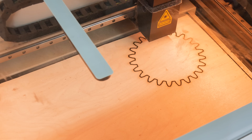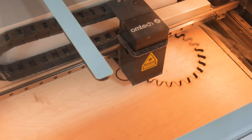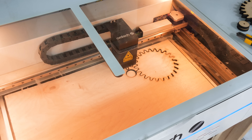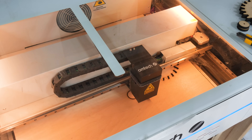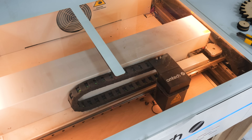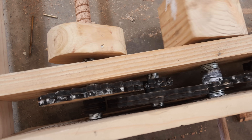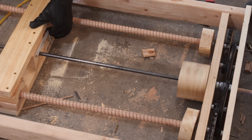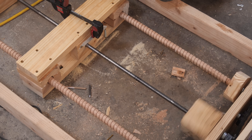So the solution to both of these problems is just to add more gears — which of course means completely rebuilding the machine. To speed things up, I used a laser cutter to help make a bunch of gears. Doing some rough math on how the gearing impacts the thread count, I figured I need to factor it by eight, which is a pretty big gear. But if it's split between two sets of gears, you only have to multiply by four on each one. That also reverses the direction one more time, so we can use our standard threaded lead screws as reference and make a standard thread rod.